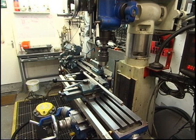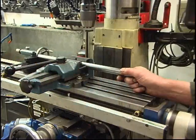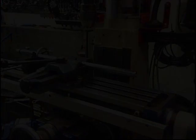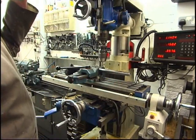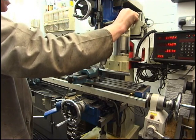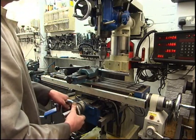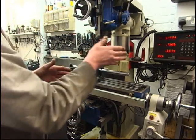You need to get that hole horizontal so you've got two holes up. I'll just eyeball it so it's square — you can eyeball things very accurately, surprisingly. We're still in the centre of the bar. We're going to go 150 thou each side of the centre line. Back to zero, then 150 thou. The DRO is good — it doesn't matter that the machine's got backlash because you're working off the DRO, not the dial.